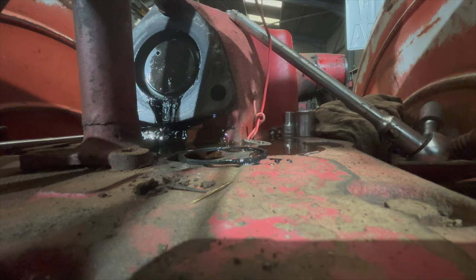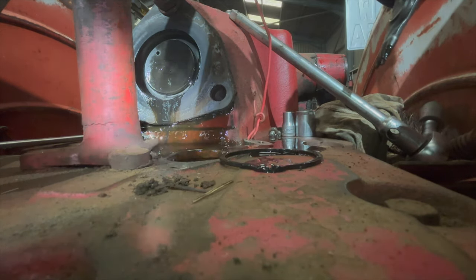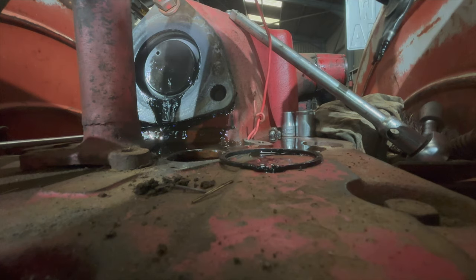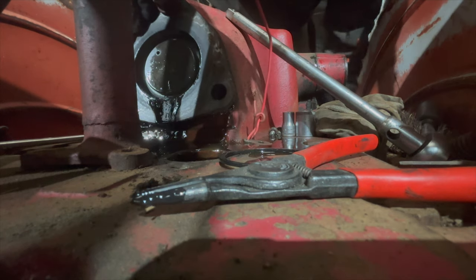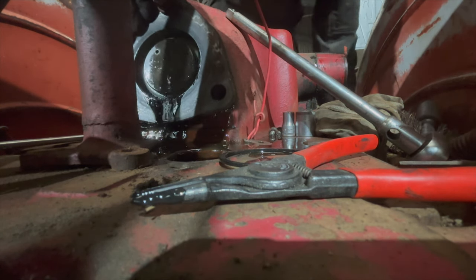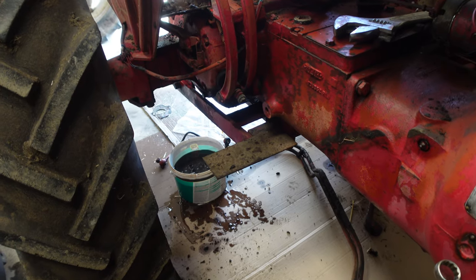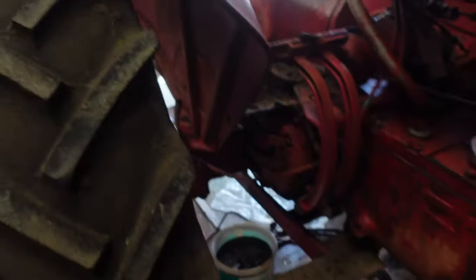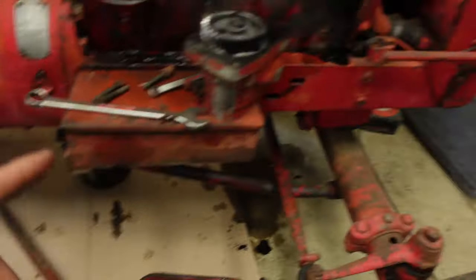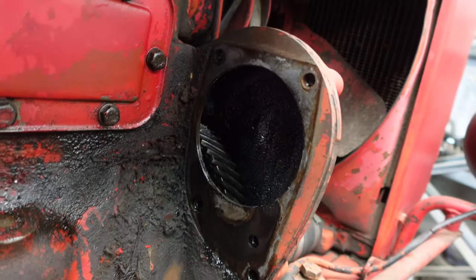This is on the Farmall B-450, as you can see the steering column going up to the steering wheel. I've put the bolt back in to hold that tube back in place so that I can hopefully push the piston out by lifting the hydraulic arms, but that didn't work. So the bolts are taken out of that steering column so I can move it over to the side by slackening the fuel tank to get the piston holder out. Moving back to the McCormick B-450, we've got the piston and the sleeve and all that plate put back on, but not the lifting lever. I've decided to take the pipes off to get to the pump. The pump goes in the housing there — I think we might have found the problem.